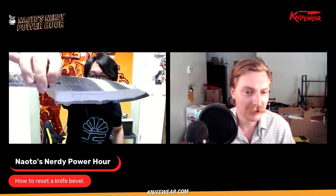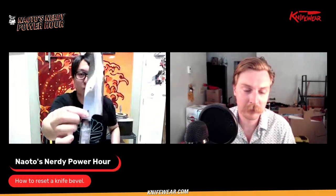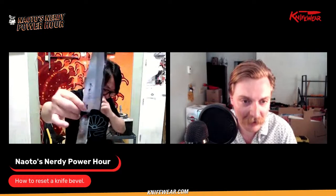What the knife makers do is they have a straight line to hide the part here, and they sandblast to make it straight. Or they put a card on the knife here, and they polish it with sandpaper, the scraper, or the sharpening stones. So if there are any imperfections, it works those out. This one here is the sandblasted one, so you can actually see a little bit of imperfection.